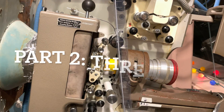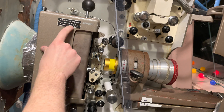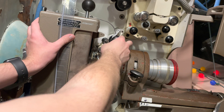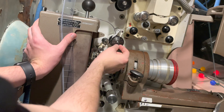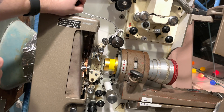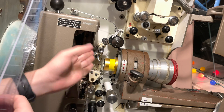Now on to threading. The first thing we must do is put it into threading position. You can still see what it says here: 'Before opening film gate, please turn projector in threading position.' Over here there is a knob on one of the main constant motion sprockets. It has these little dashes on it. We want the arrow to line up with the dash, and then we try to open it — as long as we don't force hard, because sometimes it can be a little finicky. If it seems to open okay, we pull back and lock it in. Now this is what we call threading position.